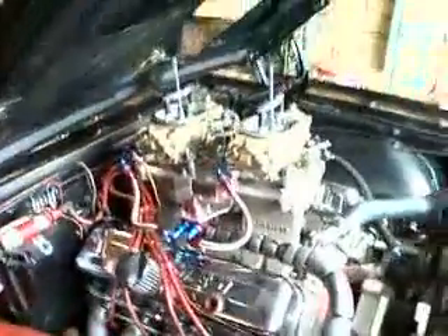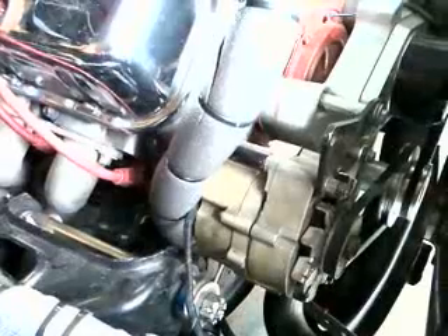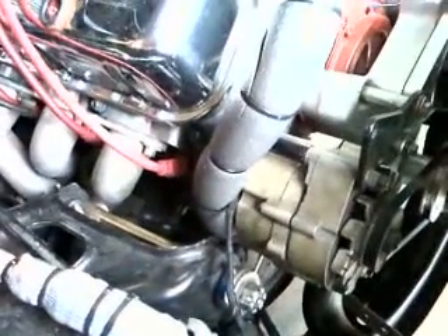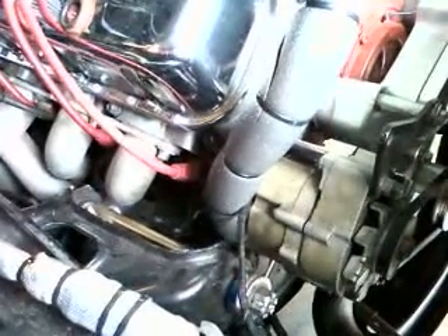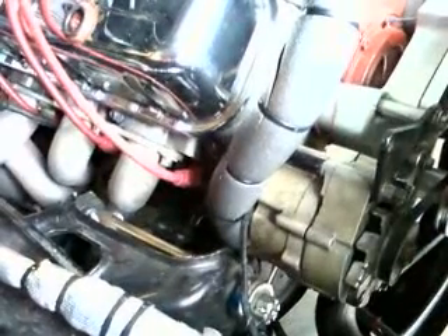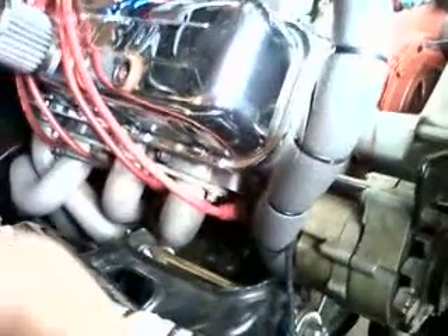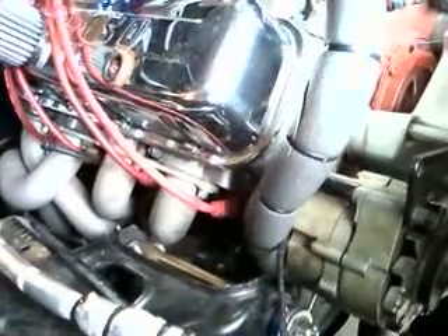The block down below where the access to the pump rod — it wasn't flat, and obviously it needs to be flat for those three washers they give with the pump to seal. So I took a large wide bastard file and filed it by hand and got it nice and flat, hopefully parallel and perpendicular to the pump. It looks like it's sealing, at least so far, and I have a vacuum pump so it probably won't be an issue.